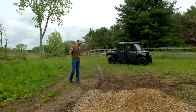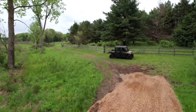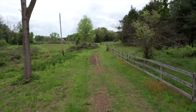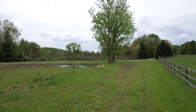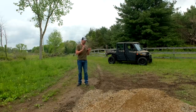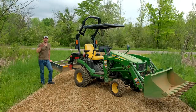As far as I can tell, that gravel did not continue — it's just straight topsoil here. So before I extend this gravel drive, I want to get it around and connect it maybe over to the paved drive. I'm going to strip out this topsoil. Otherwise, what typically happens is what happened up there with that old stone where it just kind of sinks down, because topsoil has a lot of organic matter and it breaks down. Unlike sand or clay where it just sits there — you can see the stone is already sinking down into the topsoil right here. So we want to strip away that topsoil so our gravel is not sinking into it.